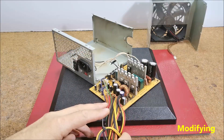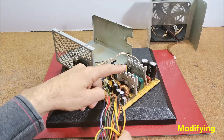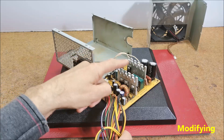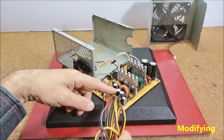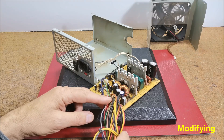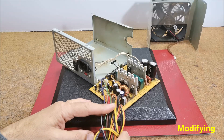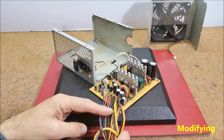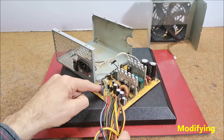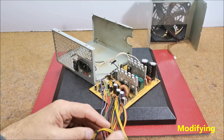The only modification we need to make is to remove the Schottky diodes, which is easier to do together with the aluminum heat sink. For this operation we usually need a soldering iron with higher power or a higher temperature at the tip. It is good to mention that with this type of modification four of the five power supplies I owned worked, and one did not start and I needed to bypass the protection circuit — but more on that procedure in one of the next videos.